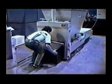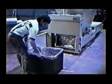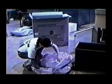The loading can is removed from the machine and the slug is removed from the loading can. The slug shown was produced by densifying 30 cubic feet of loose material. The volume reduction was 40:1. The operator can change the machine settings to adjust the slug density and length.